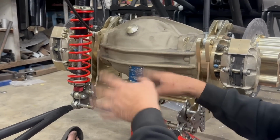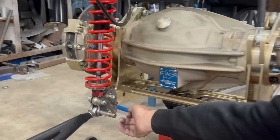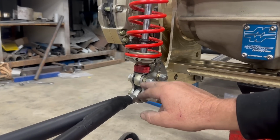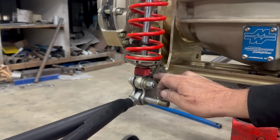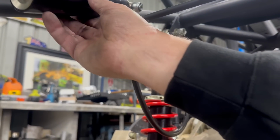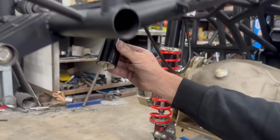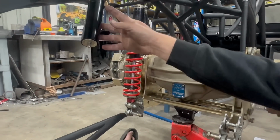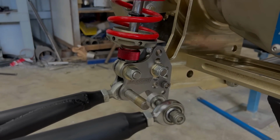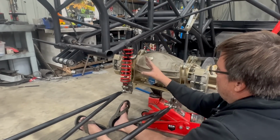All the bolts we have in here, they're just junk. They're just bolts that we're using to mock everything up. So our wheelie bars, obviously they're going to be much shorter than this, 1/2-inch bolts with shoulders, and we'll just have nice short nuts on there. And we've got our shock, it's all just clearing on the adjuster and everything. But you can see we've got the beautiful Penske shocks. They're just sort of in place there, and we're also looking at where we're going to hang these canisters so they're out of the way of the rubber, and we can easily refill our canisters and everything. But these guys here, you could probably get 10 days in the Maldives for the price of those. They're not your Bali type holiday shocks. They're right up there. So we're well on the way to getting these shocks pretty well locked away.